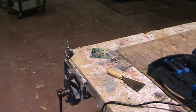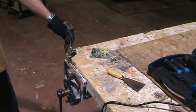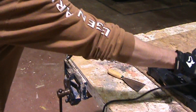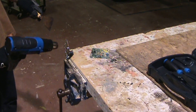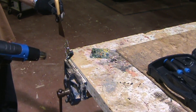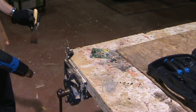Pick a corner of your board that doesn't have anything on it and lock it in a vise vertically. Take your heat gun, set it on its highest setting, and heat up the front back and forth. Pick a small section and you'll see that all the bonding will melt — you can just touch it and it will scrape off into your catch basin.